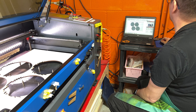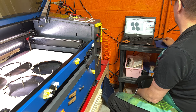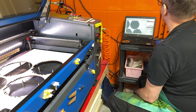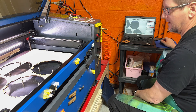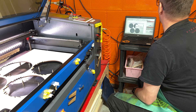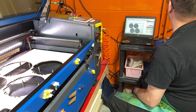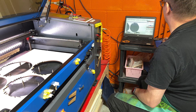Now everything is selected. I'm going to ungroup that and select outside of there. This already showed up on my tool layer because that's the last thing I used — all these are on the tool layer, which is where we want them. Now that they're ungrouped, I can individually select the outline of this circle and do an offset — outward, three millimeters — to test the accuracy up in the upper center area. That three-millimeter offset is on a tool layer, so we're going to move it to the blue layer. It's set to 100mm/s at 30% power by default, which we're good with.